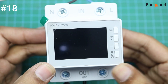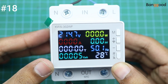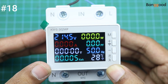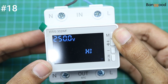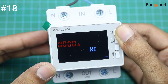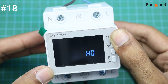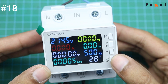Here is the other panel meter, showing us multiple things. This meter is also Wi-Fi based and in case of overload, over-voltage, and under-voltage it will automatically cut off the power supply. You can set the limits here — here is the high voltage limit and this is the low voltage cutoff limit. Here is the current, the time, kilowatt-hours, watt-hours, and the temperature. You can turn it on and off with this single button.